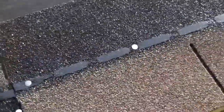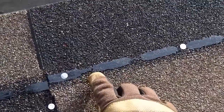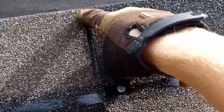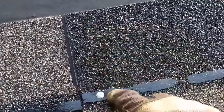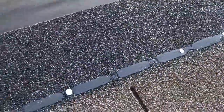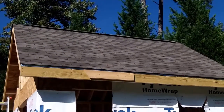Just keep nailing — you need to make sure that when you nail your rows, you nail near the nail strip. When you overlap your shingles, nailing there means you nail at the top edge of the shingle below, so each shingle ends up nailed in two places. If they're only nailed in one spot, that's a bad thing. Make sure you put at least two nails in each shingle for each nailing location.